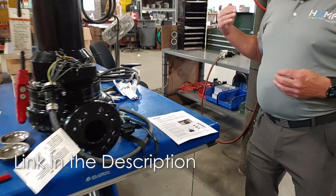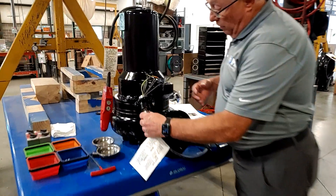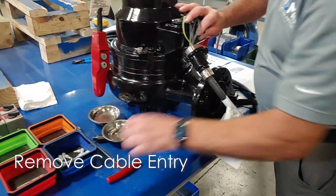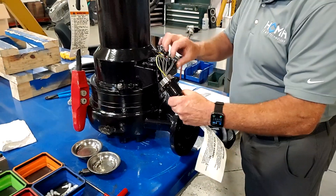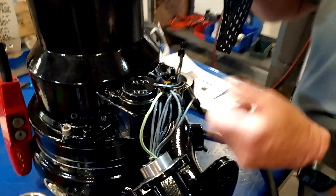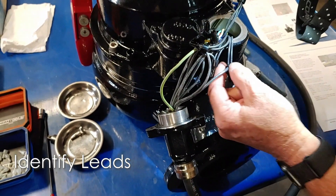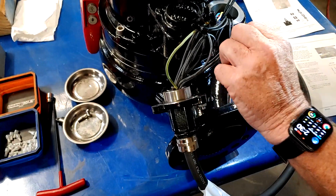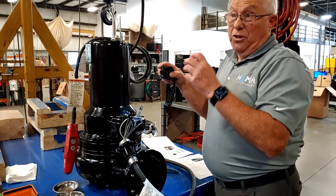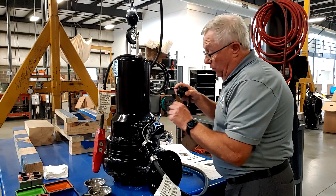That's going to give you a step-by-step procedure of how we're going to do it here today. So if I was going to change the cable, I'm removing two M5 hex bolts, removing my cable entry. I'm going to mark all my wires where they're connected. You have to look close because we don't make this easy for you. Our numbers are marked in white on this cable. Never use a solvent or cleaner on these cables or the stator leads because you'll actually rub those numbers off, and then we're playing a guessing game figuring out how it's connected. So be careful never to do that.